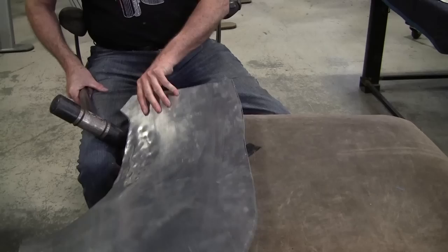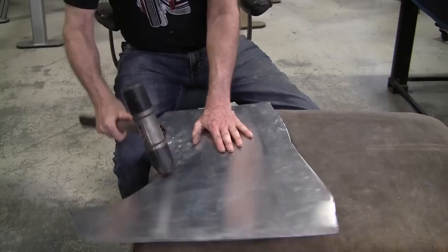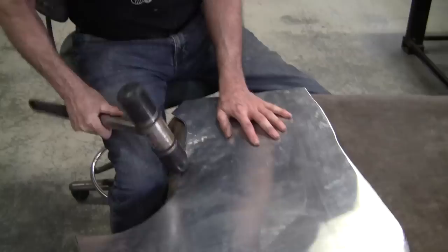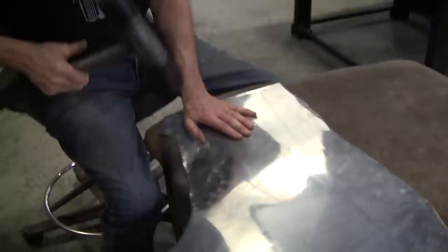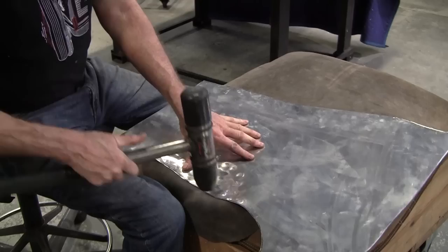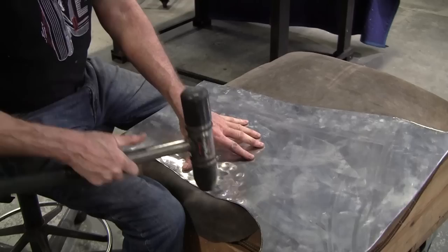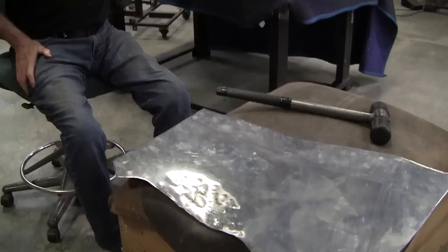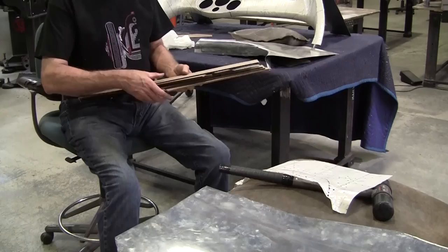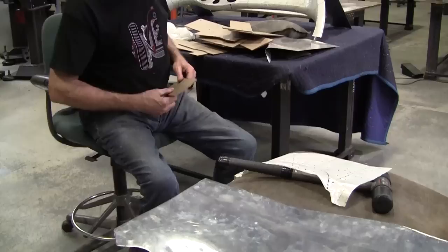This is the growth shaping — what they call elastic or plastic shaping. Then we're going to compression-shape it with the English wheel after we create the area value of the panel, guided by the flexible shape pad. If you're new to the concept of the flexible shape pad, I've got a bunch of videos showing how to use them, and we do sell the correct tapes on our website. You use the flexible shape pad not just by itself — by itself it gives you a ton of information — but we also have all these gauges, which show all the subtleties of how much you need to come up.